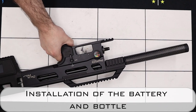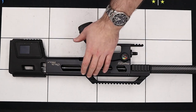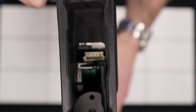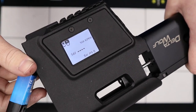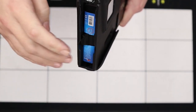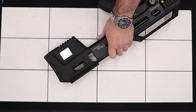We can see the dimple in the side of the rifle, so now we're going to install this grub screw using a 3mm Allen key. With that done, the rifle is pretty much totally rebuilt. The next thing we're going to do is reconnect the battery and then reconnect the air supply. We'll start with the battery first — pick the rifle up and stand it on its end, and the battery connection goes into this socket here. We see the battery's reconnected, and if we look on the side the display has lit up. Gently fold the battery back in and put it in position. Then take the butt piece and reinstall it in the back.